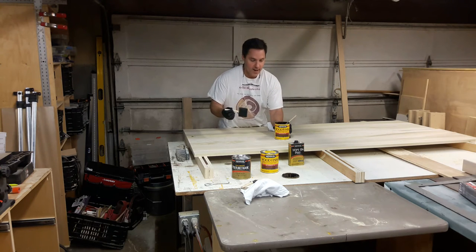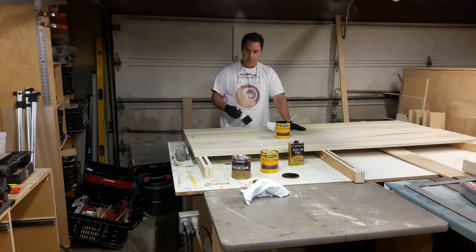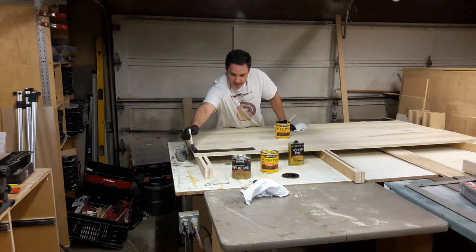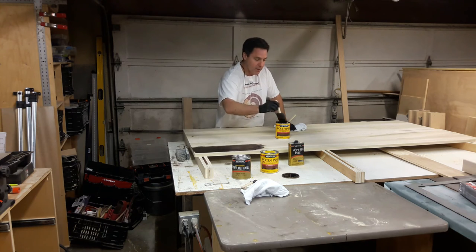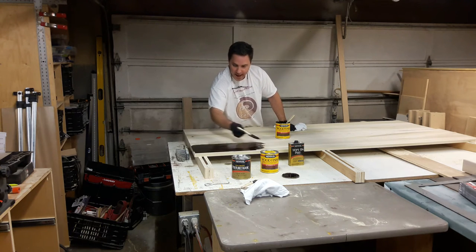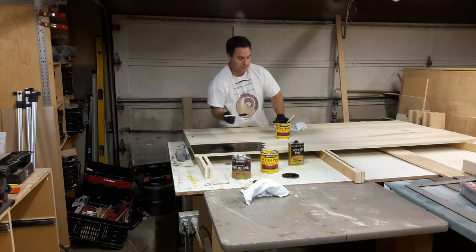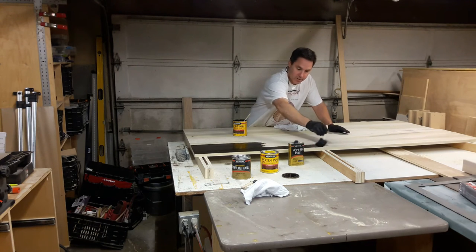So I'm just going to dip right out of the can. These boards are one-by-fours, there are eleven of them making up this panel, and I'm going to do about three at a time and then wipe it off. You can see the first coat goes on kind of rough. Dark walnut is dark — a very dark brown, not really black, but it's a very dark brown and not very soft in my opinion. By putting the red mahogany on it, you're basically lightening and warming it.